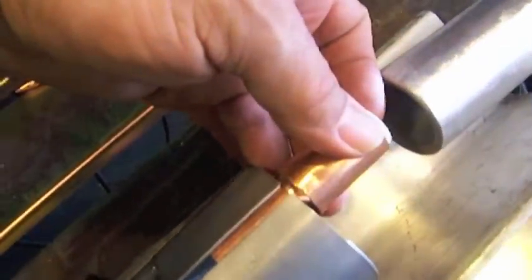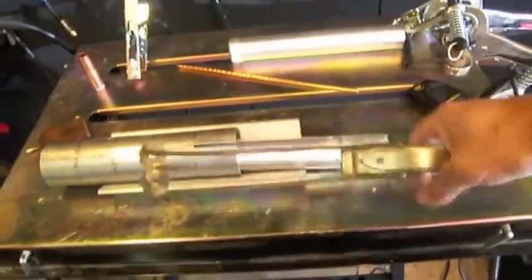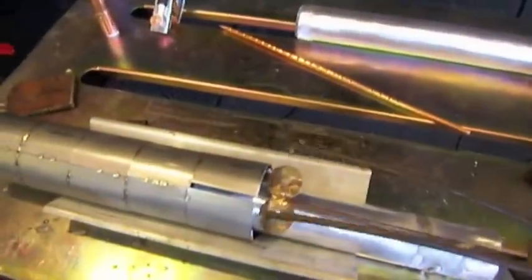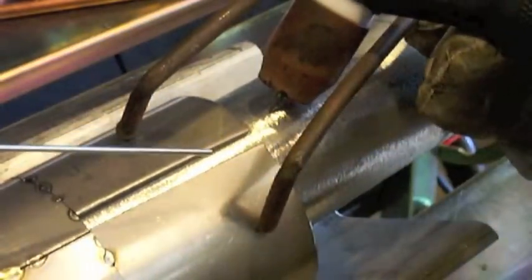I found this old MIG nozzle for a machine I don't have anymore — I could clamp it up in there, it's about the right radius. But I don't want to mess up the MIG nozzle, and I've got the piece of aluminum tubing that's not going to be good for much else, so that's what I'm going to use. I'm going to use this pony clamp with some extensions welded on it — a handy tool for clamping backup material. It's got two prongs on the side I weld from that let me get the torch in there. That's going to hold my piece of aluminum tubing right where I need it to make this weld.